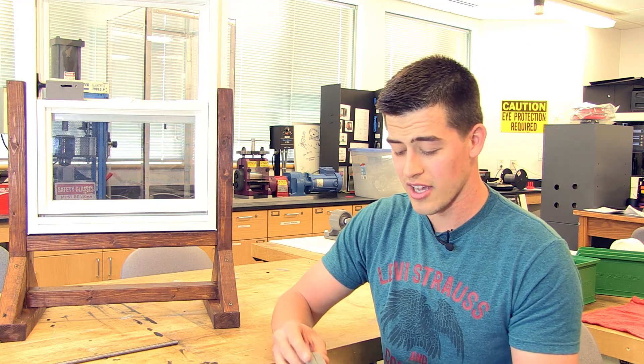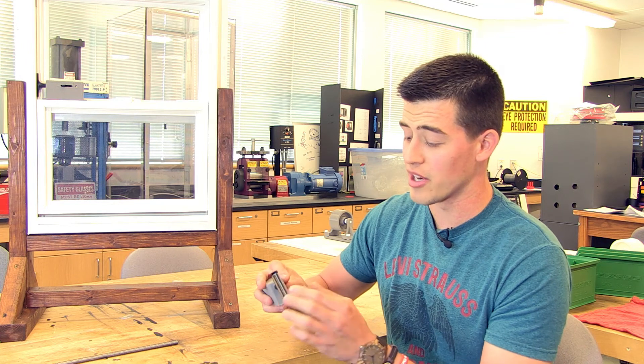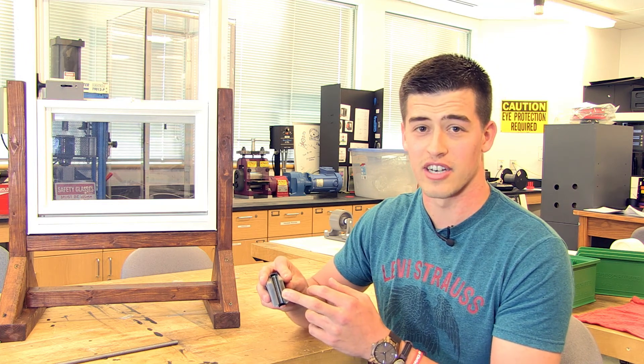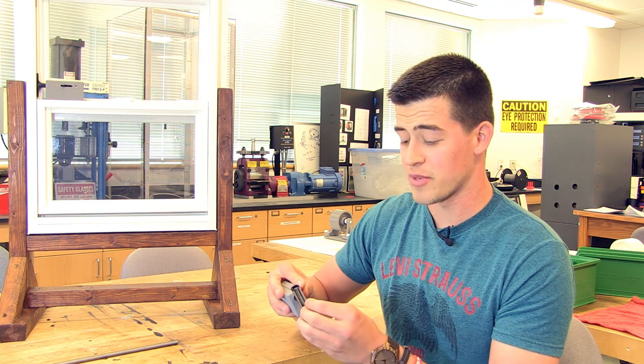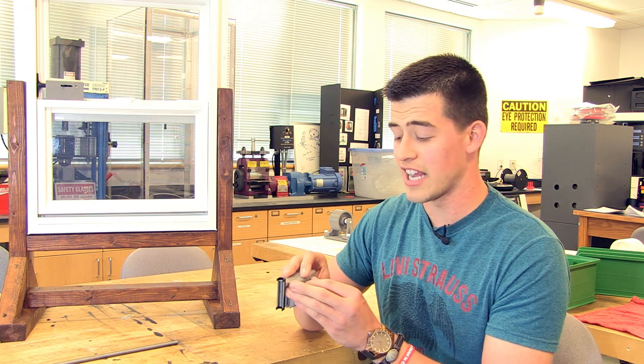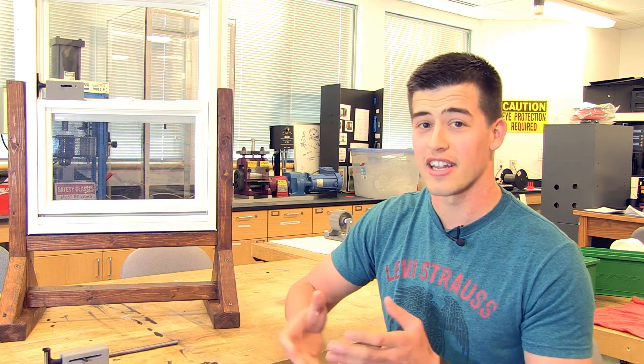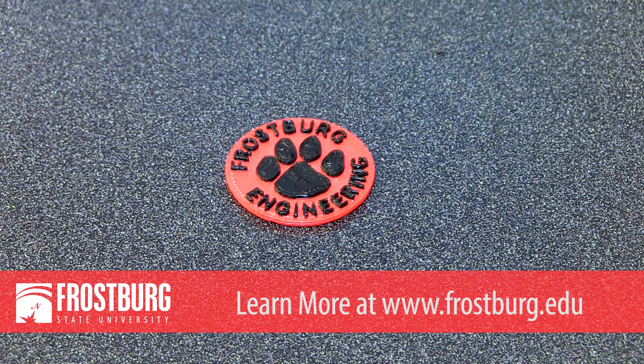As you move the slider out, it will engage with the rod so that as the rod spins, your slider moves up or down depending on the direction. This entire piece was 3D printed in three separate sections — we have two halves that we were able to snap the middle section into, and actually put a nut that we bought from the factory. The nut had certain specifications, we mirrored those specifications in the engagement mechanism, and they matched perfectly. The printer has the capability to achieve really tight tolerances to make whatever you need. That's how our invention, the Window Wizard, works.